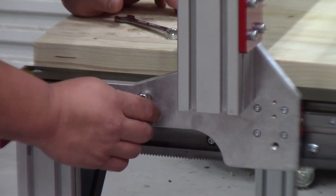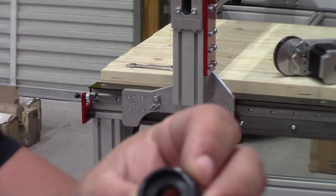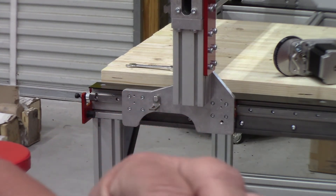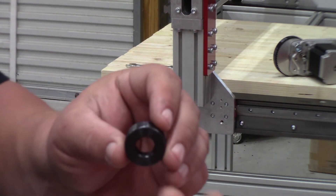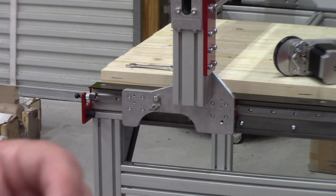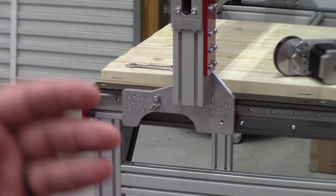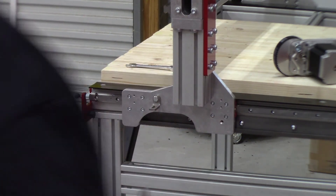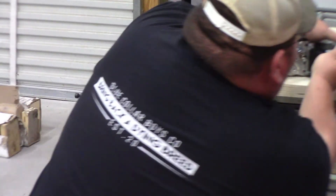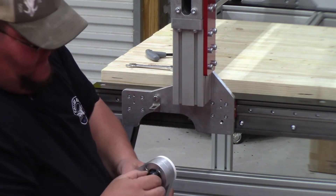Again, you don't fully tighten it — just leave it somewhat loose. Now we're going to install the motor. This is an eccentric collar, and it's oblong — it's a locking collar. Once you get this shaft screw in place, this basically locks in. The bearing inside that motor plate is what's going to be the pivot, and the movement will be on the bearing. Slip your collar on there, grab your motor, and turn the collar to make sure it seats on the shaft.